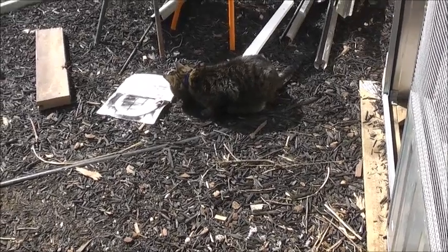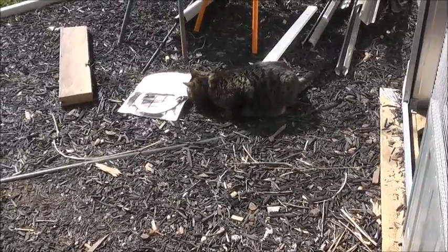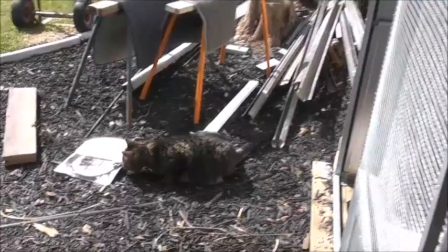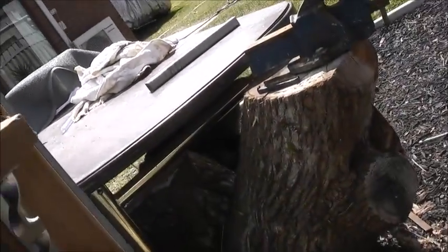My cat Whiskers found something - a gecko. My suspicions are actually correct. I've got continuity from neutral, active, or any of the speed wires to the body of the motor, and they give a spark. So yeah, she's gone.